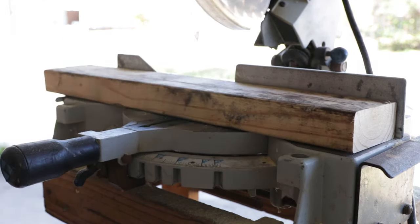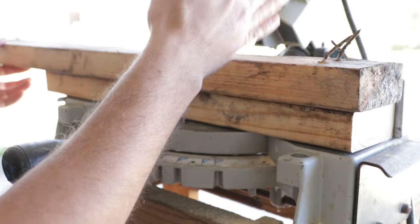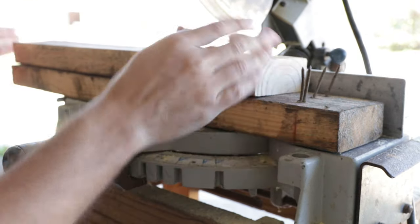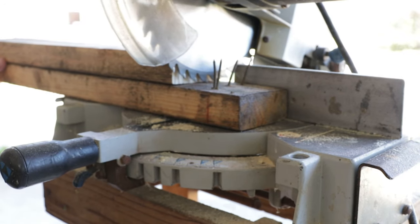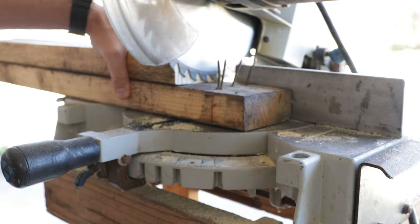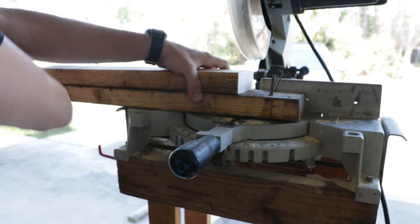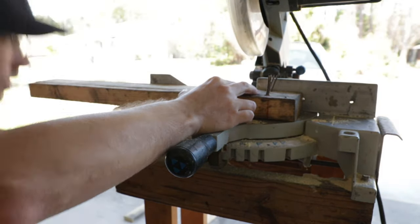This is my 20.5-inch piece and I want the next piece to be the same. Both ends have nails, so I'll chop off past those nails first to get a nice clean cut. Then I can stick the reference piece on top, slide it back, bring the blade down and press up against it. With my left hand I can feel they're virtually exactly in the same position, and the saw blade is right against the mark, so the cut will make them exactly the same size.